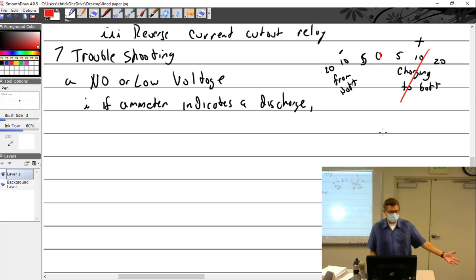I used a heavy battery load. The battery is now discharged somewhat, not a lot. So as soon as the alternator generator comes online, you're going to watch that needle go back towards just the other side of 0. So it's always going to be on the positive side, because the battery's always going to take a little current to keep it charged.